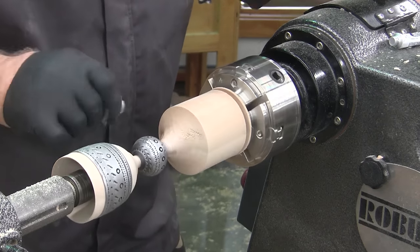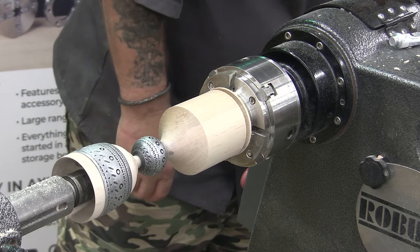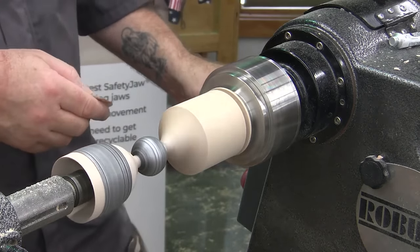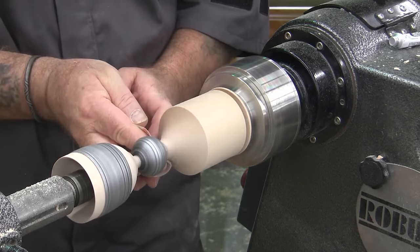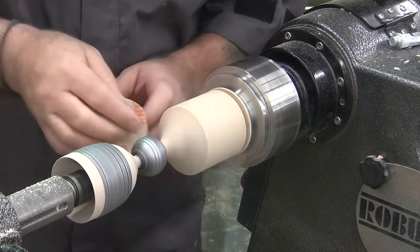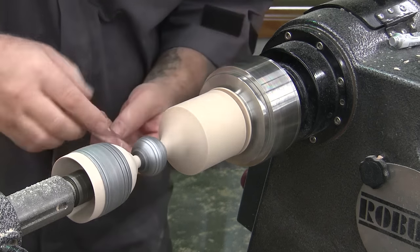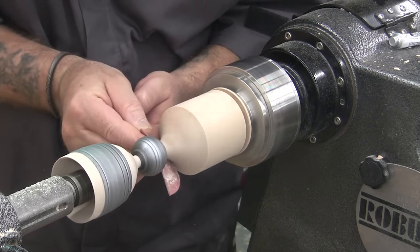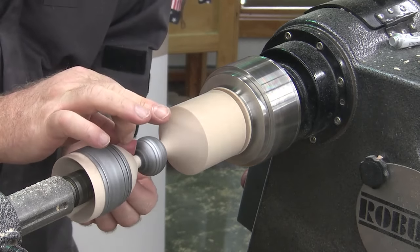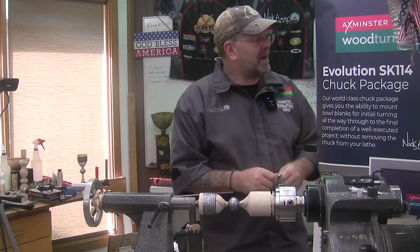Going back gently with it stationary, you see it just makes that a little bit more shiny. Then I'm going to sand off where I've overdone it a little bit and hit the original area, pre-sanding, just so I have to touch that area up. We're working fast today - you've got a little bit more time when you're making this in your own time. We'll take the 240 or 320. And then we'll go to the 400 just to clean it up - it's not really needing to be over-aggressive. Right, back over to you, Colwyn.